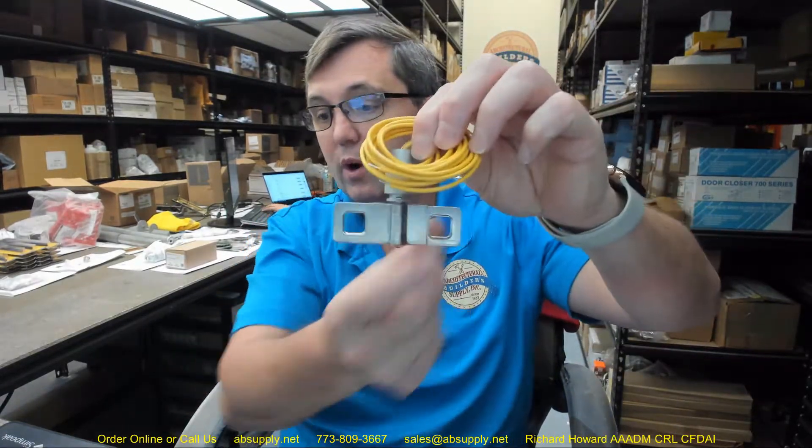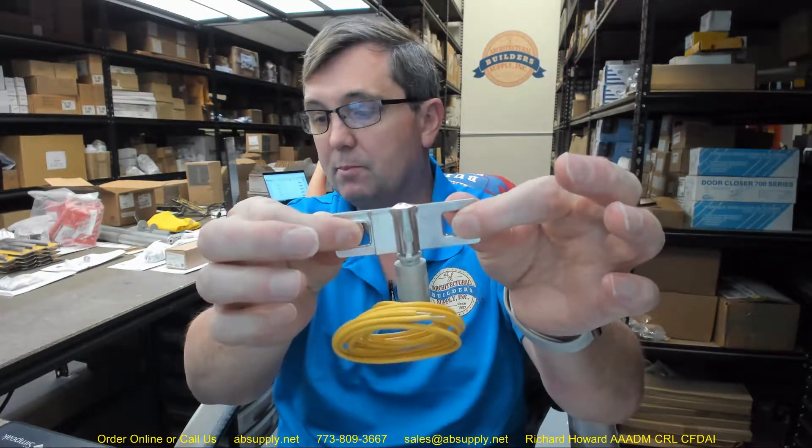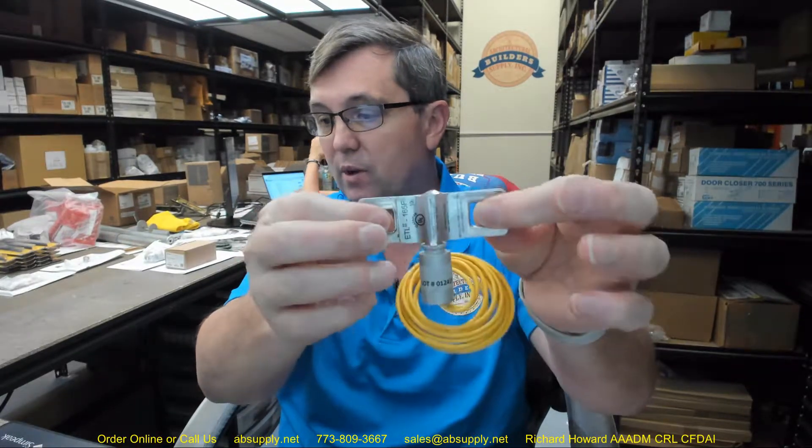The installation instructions indicate that the ETL is typically designed to be mounted on dampers and ductwork, roof hatches, fire doors, and other uses where retrofit or replacement of standard fusible links of 40-pound rating or less is desired. It is typically attached mechanically by placing metal strips or S hooks through the square link halves opening to provide a floating linear force tension of 2-pound minimum and 40-pound maximum. The ETL has a 40-pound maximum continuous tensile strength end-pull at standard temperature, which can only be achieved in installations where the link is subject to equal linear tension. If side or peel forces are encountered — typical in most smoke damper installations — the weight may have to be reduced or the tension vector re-established.